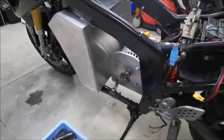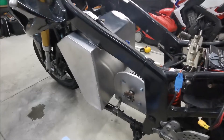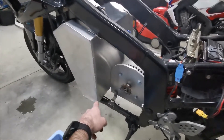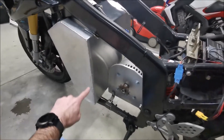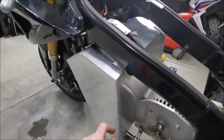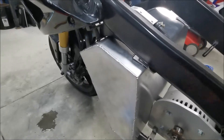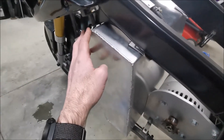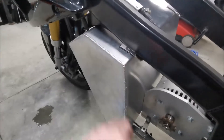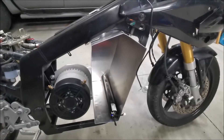With the loaded output of this motor, the big rear sprocket I made is going to be unnecessary — the bike's standard sprocket ratio is almost perfect for a comfortable 100 kilometers per hour or so. I've also started assembling the battery compartment from two millimeter aluminum that I folded. I'll put a little bit at the end of this video about how I folded that, and I've tack welded the sides. TIG welding aluminum is actually quite a fun part of the project — a lot of people consider it hard, but it's substantially easier than arc welding. If you've done soldering, TIG welding is a very natural thing to do.